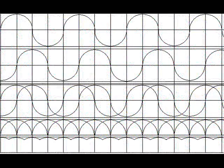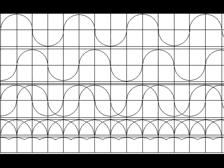You can see the difference between the two sine waves at 90 degrees, noted in green. A diode bridge rectifier turns the negative half of these two waves into the positive — it makes it look like there's no negative half at all. I'm still showing two sine waves on the bottom, which is why I still have the green between the two phases, because both coils have been through diode bridge rectifiers but still have two separate outputs.